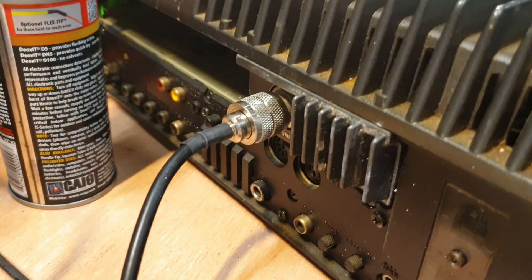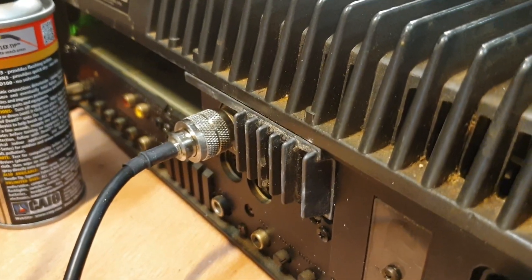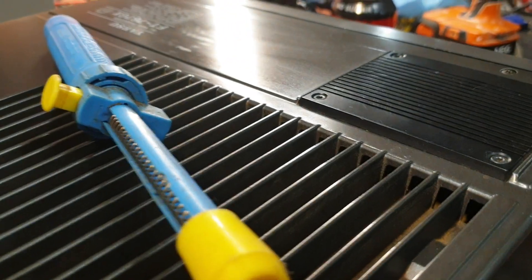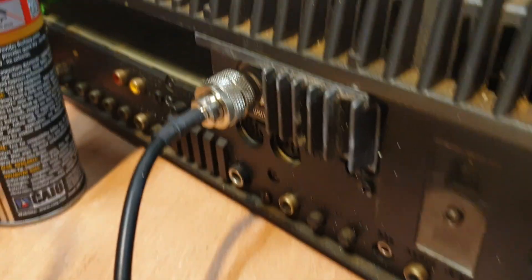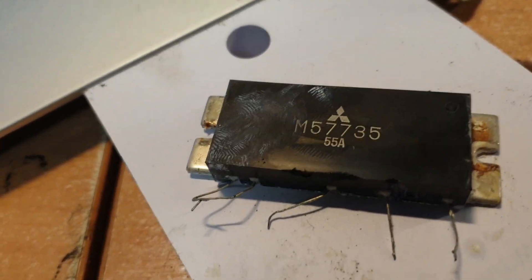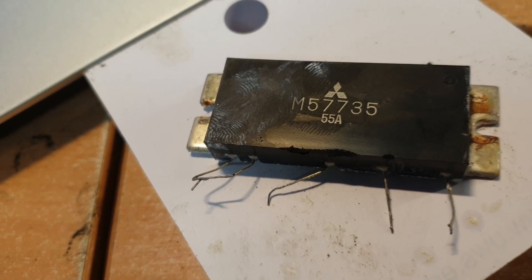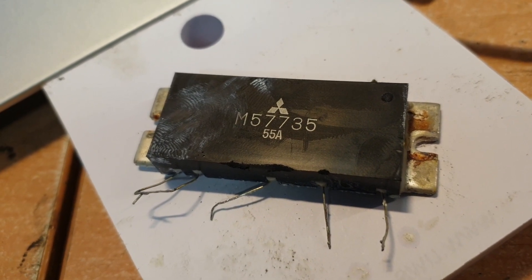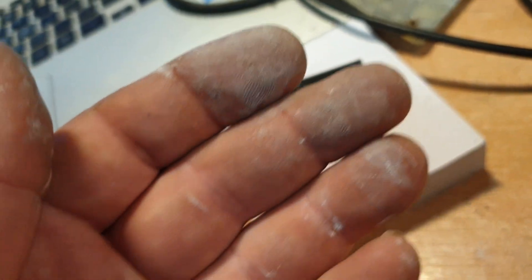Basically we know that this is dead. There's no way of actually proving there's pre-drive there off the board because we just can't sniff into an area where there's just no access. There literally is very little access — there is a way you could do it: you could actually lift this up and have it sitting on like a 45-degree angle and maybe be able to get in and sniff out a couple of things. But in this particular case, no, I don't need to. I pretty much know — I had a quick look at just what they were doing there, and yes, this device has a fairly low-level input to produce this 10 watts. So it is dead.